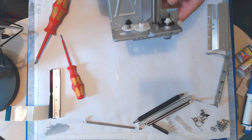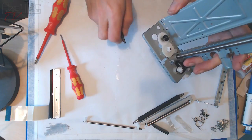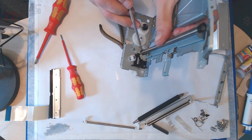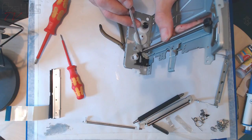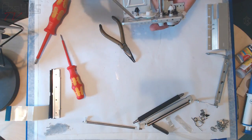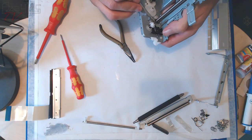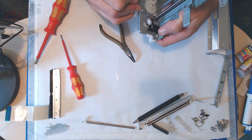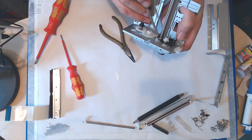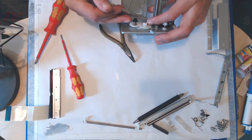There's another circlip — if I can take that off I can slide the rod through. The circlip is down in there. I don't think I can use the pliers this time because it's nestled quite tight. Maybe I can use this. These circlips are very thin metal and they need to flex outwards to go around a groove in the rod.